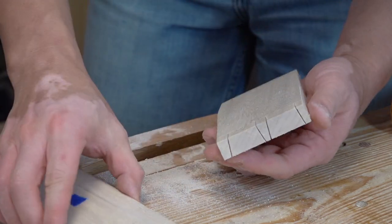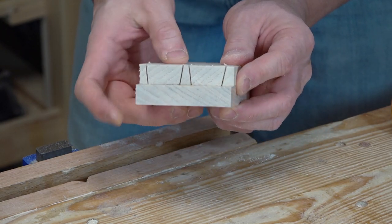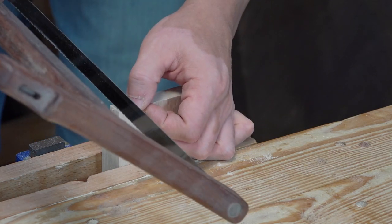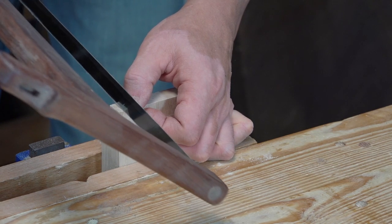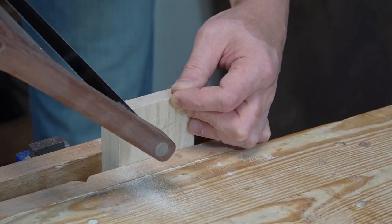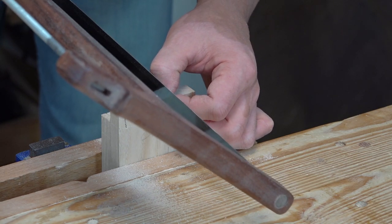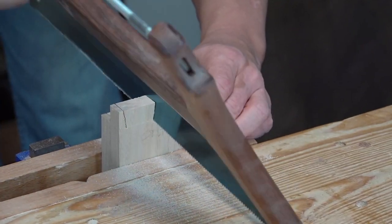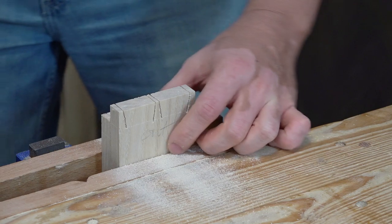I take the other piece and put it on like that. I've aligned the tail piece up against the marking gauge line that I had made. I'm going to cut the tails using the pins, aligning my saw to the outer edge of the pin, and then visually following that angle towards the inner corner of the pin. This cut is offset by the thickness of the kerf — otherwise the tail side will be too small for the pin side. If that sounds confusing, I have a graphical illustration of what I'm talking about at the end of this video.